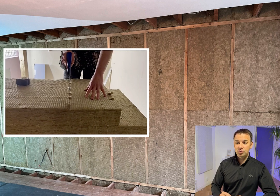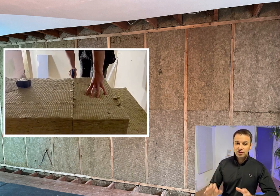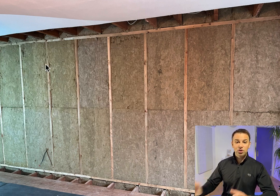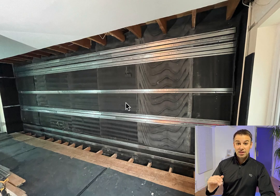Next, we insulate that entire frame, and like what you did with that first layer, that foundational sound deadening rubber that we've used in this project, the rock wool goes everywhere. You absolutely insulate every nook and cranny that there is. Not too tight, not too loose, but you insulate everywhere. Next, we install another membrane. This one is a lightweight barrier mat, and it's really important that it's a lightweight barrier mat.